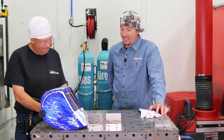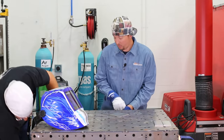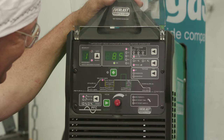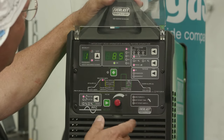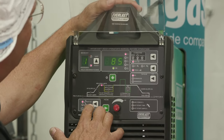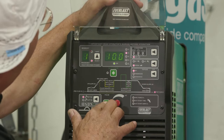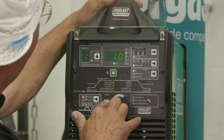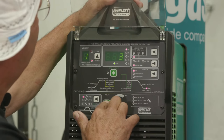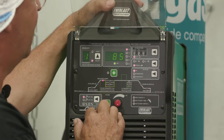So what's the first thing we want to do? We'll just do a regular one here — a nice flat joint to get started. Going back through the machine setup: torch is on the negative side, positive ground gives us DC EN. Got your foot pedal hooked up. We're at 85 amps, high frequency, running off the foot pedal. Preflow of one full second, five starting amps, ten seconds of post flow. We're running about 25 cubic feet per hour on our argon. Pretty simple setup on this machine.